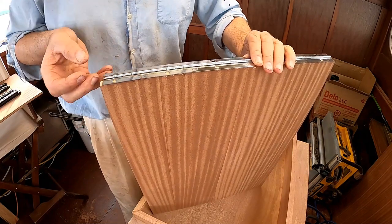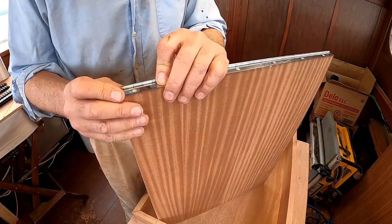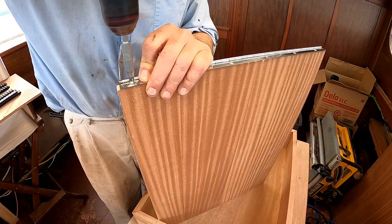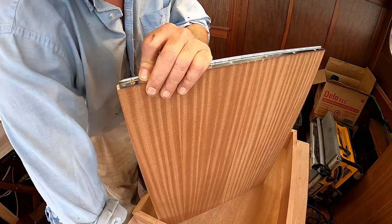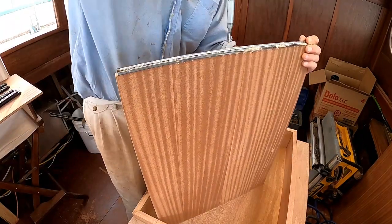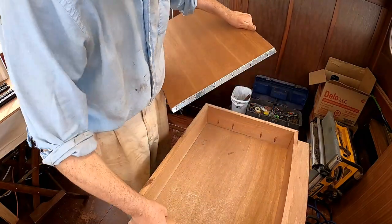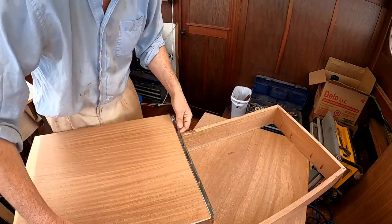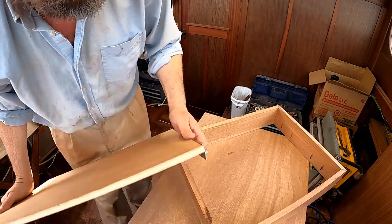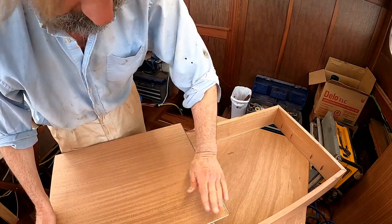And then when I choose to line it up with the door, I'll set the putty. You'll see what I'm doing. Let's just get this on here. You'll always remember my pushy, springy, loaded thingy-ma-dooey gobby here. Now I'm going to start with small screws just for the test fit. Okay, and to line it up on here, I'm just going to set it up so this face is flush with the edge of the frame. And then the advantage of that is when I flip it over, the hinge will be higher on the frame than on the door panel, so the door panel will be recessed slightly.